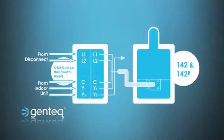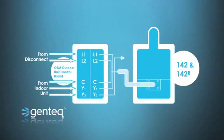The 142 motor can be powered with either 208 or 230 volts AC, and the power to the motor can be plus or minus 10 percent. Find the L1 and L2 wires on the schematic at the OEM control board. Turn the power off, disconnect those two wires, turn the power back on and check for voltage at the L1/L2 connection. If it was a plug, remove the plug before checking voltage on those terminals. If we have 208 or 230 volts at the terminals going to the motor, then that input is correct and we can move on. If we do not, we have to find out why the power needed at the motor is not there.